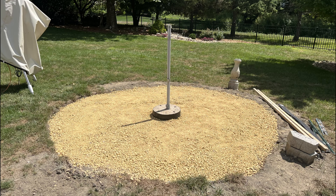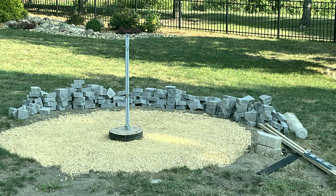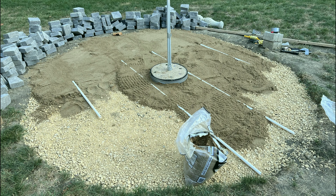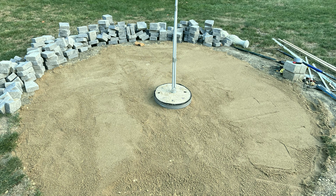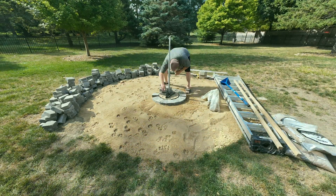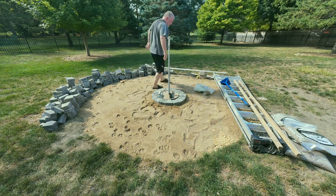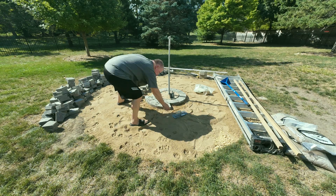After tamping, everything was done with the gravel base and I was ready to move on. I started in on the sanding after I got all the paver blocks hauled back around here. I needed to add at least one and a half inches of sand — approximately between one and one and a half inches. The process was the same: I was using some one inch tubing here to screed and get level with. Once I got all that done, I had my sand base ready to go ahead and start laying out the pavers.